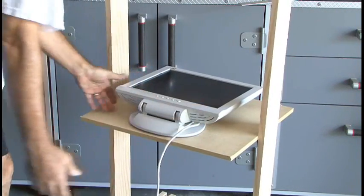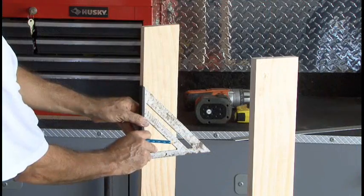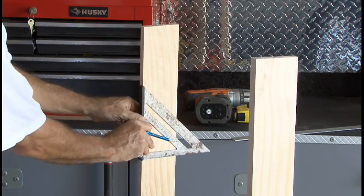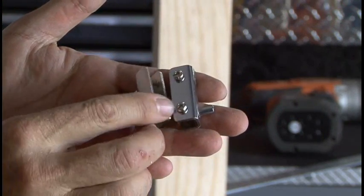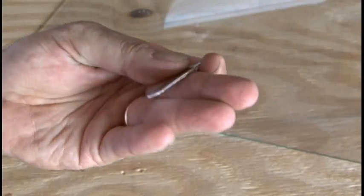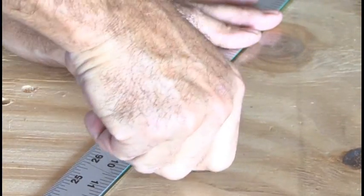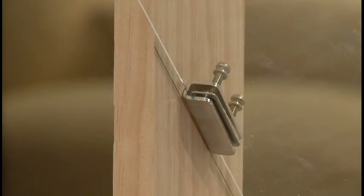You might want to use something a little bit larger to match the overall base and glass size. The final piece is the glass, and that'll be mounted at 45 degrees. So I made two marks on both of the uprights, then I'm going to use some small glass brackets and mount each of those brackets to the uprights. The brackets came with small metal protective pieces with a sticky back, so I'll stick those to the glass just to prevent the glass from cracking when they're screwed in place.